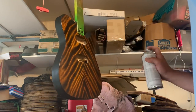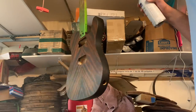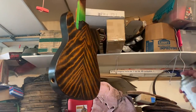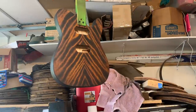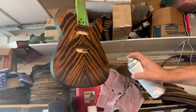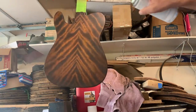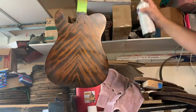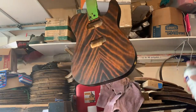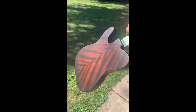We're going to do three coats of sanding sealer. The first coat is a mist coat - it helps lock in the colors so they don't bleed. The second coat is a little bit thicker, making sure I'm getting even coverage. The color scheme is outstanding on this. Do the sides as well. The third coat is the heaviest. You can tell the sides really do need that feathering - it'll just tie it together better. Hand rubbing was not going to give me the effect I wanted, so spraying really helps here. This is shown outside in the sun so you can see just how amazing this looks.